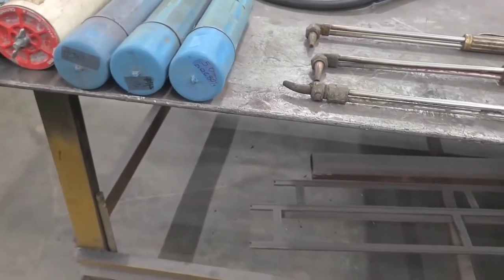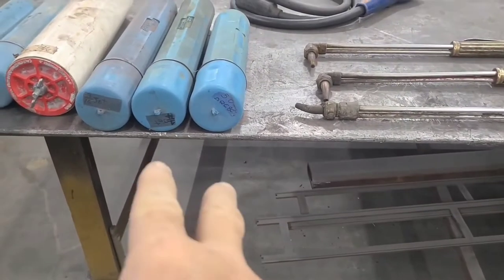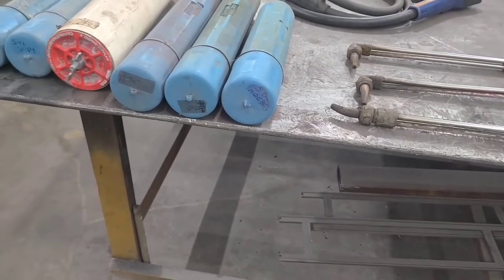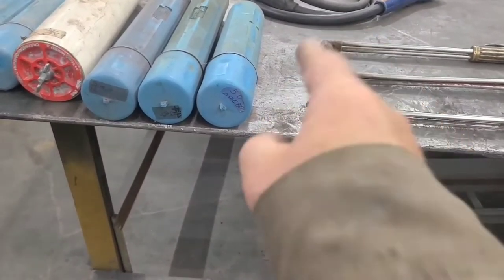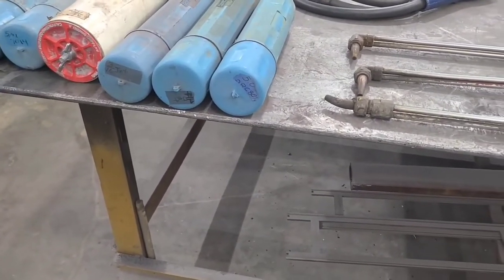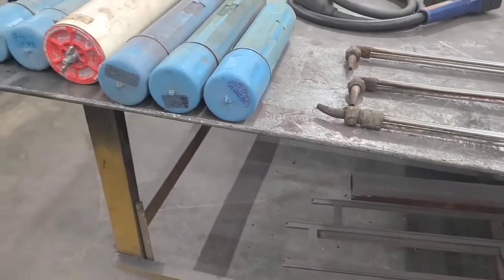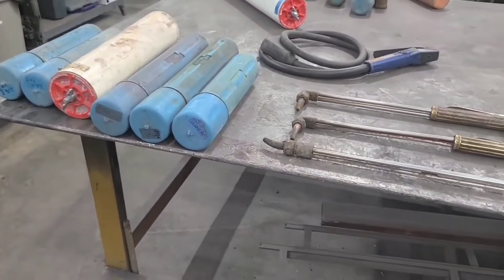Now that's a pipeline rod you wouldn't normally use on a bucket, but I tell you, you'll get in situations sometimes where there's a really tight area to reach in and you need some weld, and with a low hydrogen electrode or a jet rod, you'd almost have to gouge more out to get that rod in there to make it work. But with the 5.0 pipeliners or even a different size pipeliner Arc 80s, I'm not afraid to reach in there with that and hit it with two or three passes of the pipeline rod and then go over it with a structural rod, because that thing will dig back in there, man. It'll get right back in there.